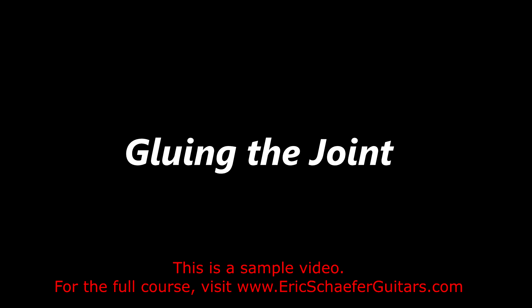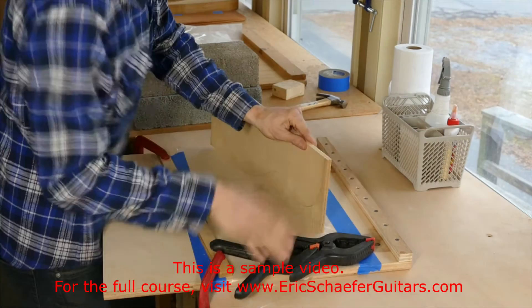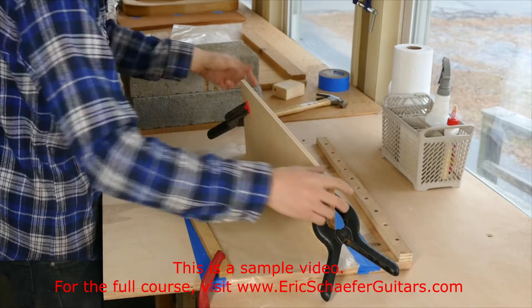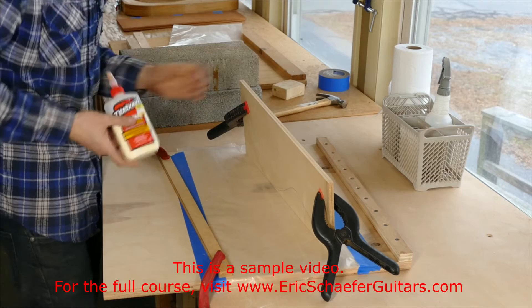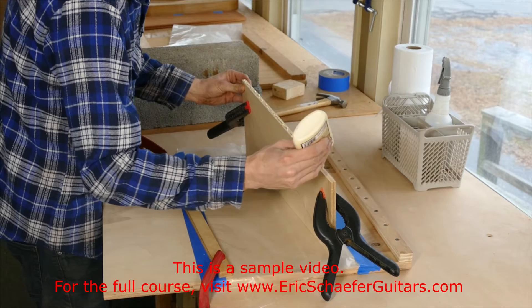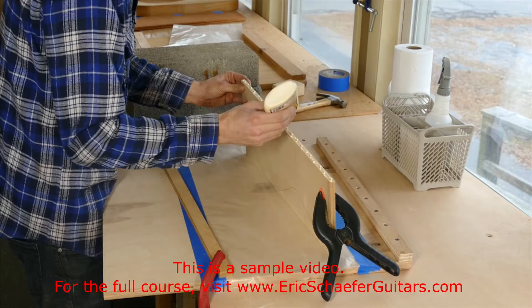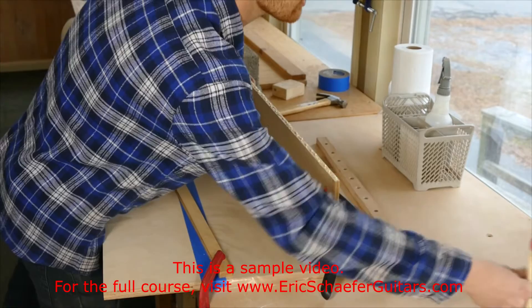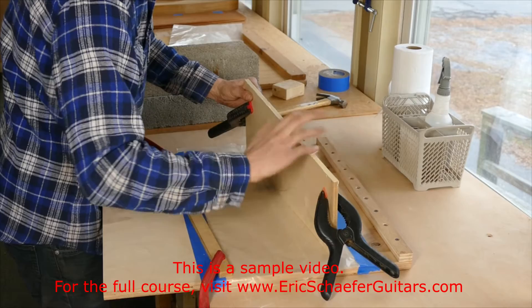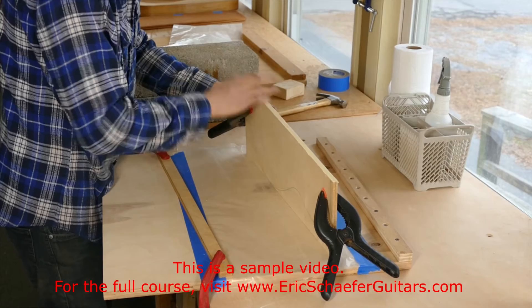To make things a little more hands-free, I like to hold this edge with two spring clamps so I can focus on spreading the glue. You don't want too much glue and you certainly don't want too little. If I had to err on either side, I would always err on the side of too much glue — in which case you just have a sloppy mess to clean up. Too little glue and you have a starved joint, which can fail. You have the right amount when you spread it on the edge and it just covers everywhere — as long as you have full coverage.